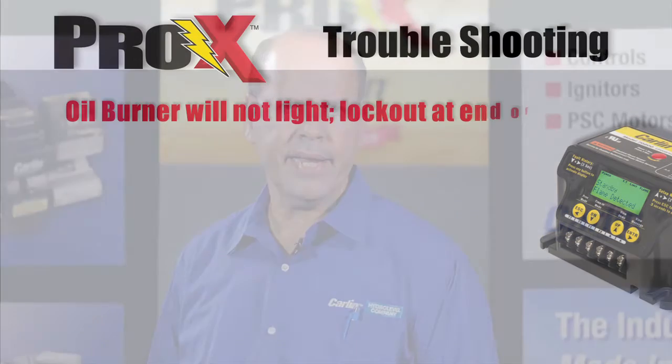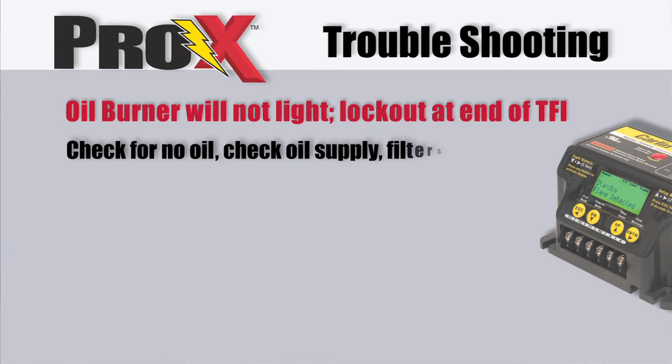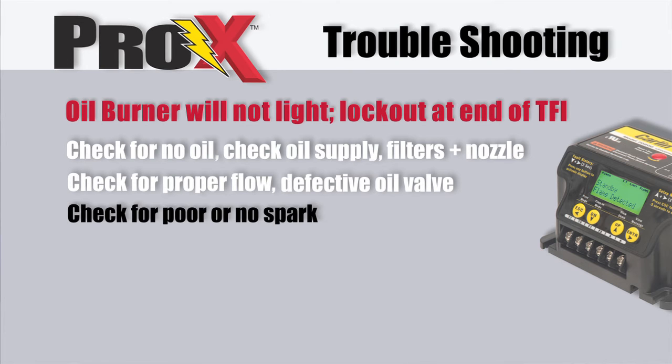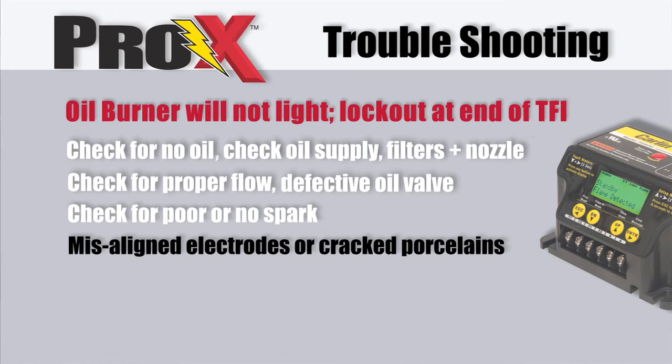If the oil burner will not light or lockout occurs at the end of trial for ignition, check for no oil. Check your oil supply and filters. Is the nozzle clogged or restricted? Check for proper flow or defective oil valve. Is there a poor spark or no spark at all? Check for misaligned electrodes or cracked electrode porcelains.